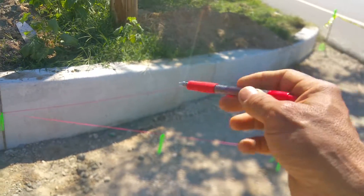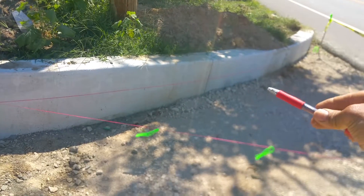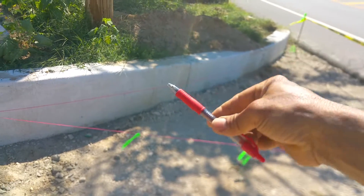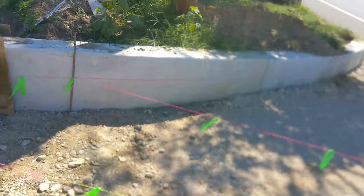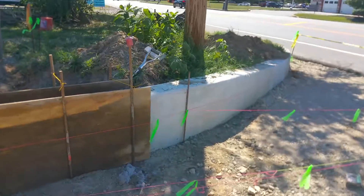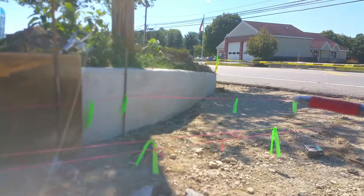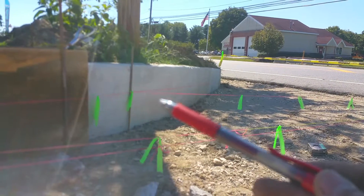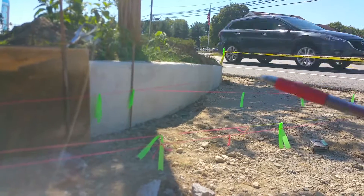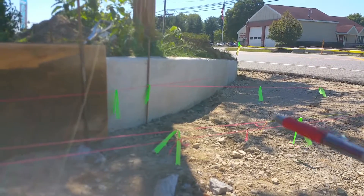It's created like a little triangle of water that's going to run off, but it's got a little bit of a compound thing going on here — something like that. But it's nevertheless still running towards the street. That will give us an 8-inch curb, that's why it comes up to be a little compound. How much is it off within that distance? Probably only an inch and a half in there — it still falls under a nice slope from here to here going that way. After you get to here, it's all resolved.